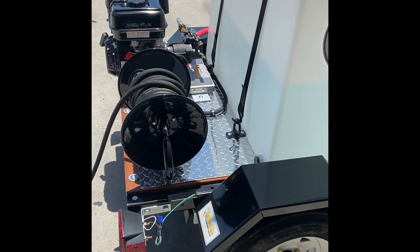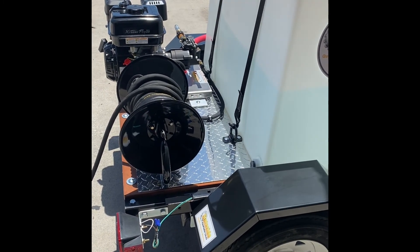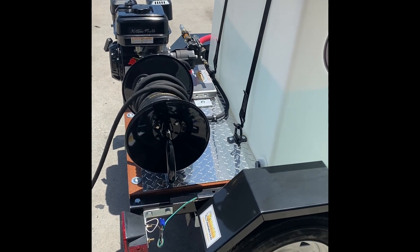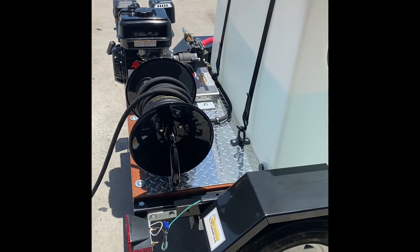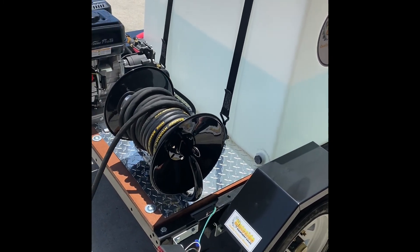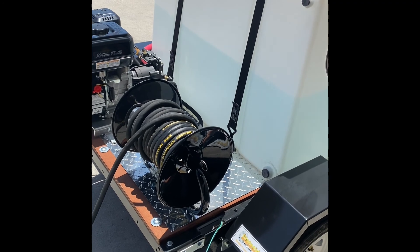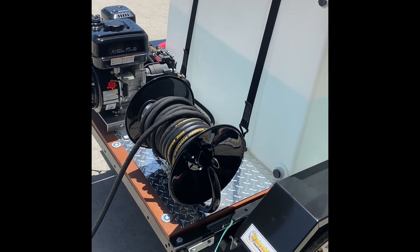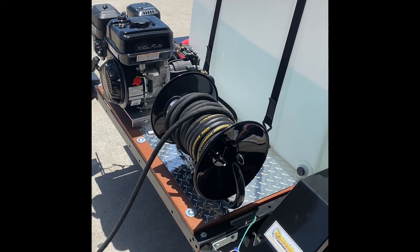On a specific pump like this, people run into issues where it won't pump water and they think something's wrong with the pressure washer. Most of the time it's just air — you need to get the air out of the manifold. It's kind of like bleeding brakes. This topic comes up a lot; there are a lot of people that struggle with it even after we coach them, so this video is going to really help.